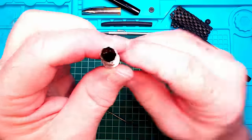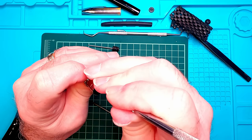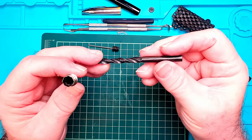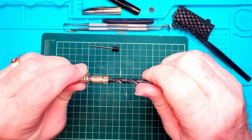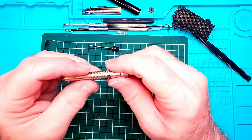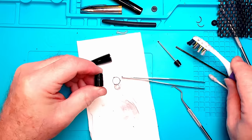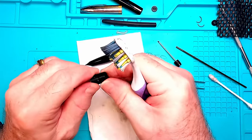You can see how that tip has a feed system on the inside of that small hypodermic needle, and the back part of the snorkel has a little bit of a feed piece on it as well. That needs to be cleaned up. I'm going to go at the inside with a dental scraper and scrape out the remnants of that sack — it's all ossified in there. I'll also use the right diameter drill bit by hand — very slowly — to tease out the remnants. You have to be careful because that's very thin aluminum.